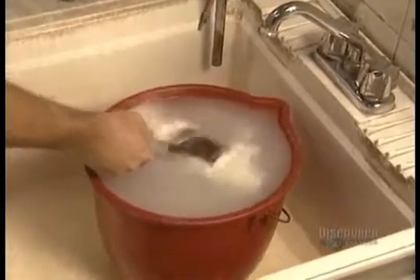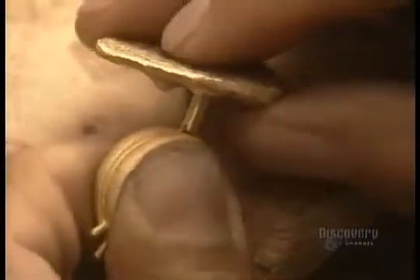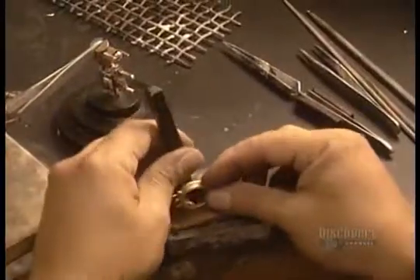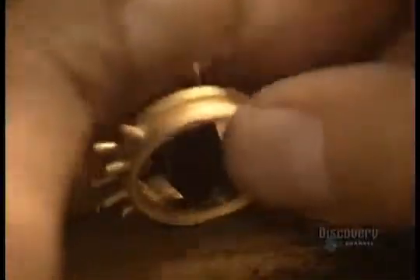The jeweler then immerses the cylinder in cold water. This cools the gold and makes the plaster disintegrate. What's left is the cast gold ring, but its surface is rough, so on to the finishing process. The jeweler saws off the stem and gets to work. He files and grinds the ring until the surface is smooth. Then he stamps on his trademark and the carat marking, and hammers the ring on the mandrill to make it perfectly round.